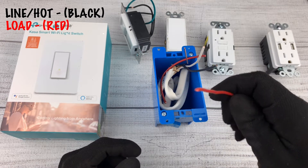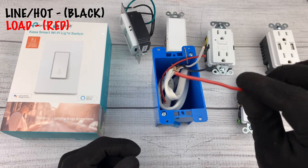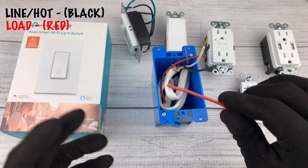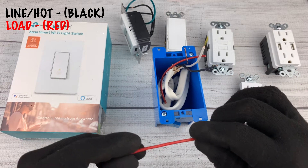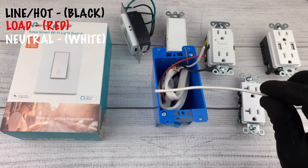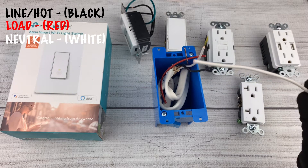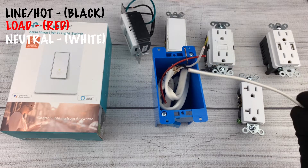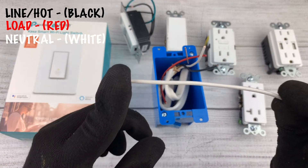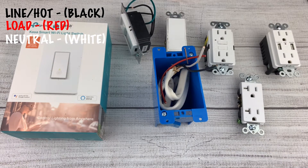The load is usually represented by a red wire. The red wire, or load, is usually the device that is getting powered, so this wire would typically go to either a light bulb, a fan, or any other device that you're trying to control. The neutral wire is the second part of the power cable that returns any excess voltage back to the panel. In most cases, the voltage in the neutral cable will be zero volts, and usually the neutral is represented by a white wire.